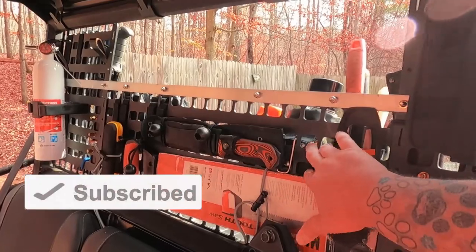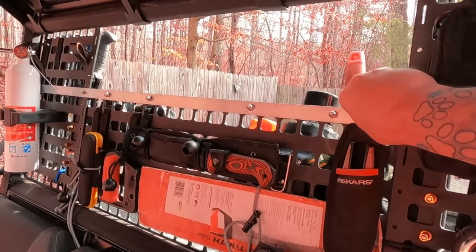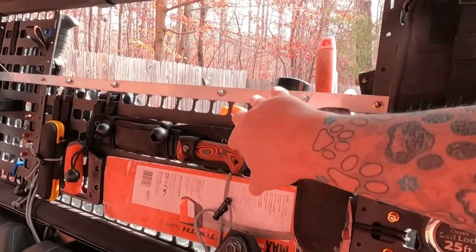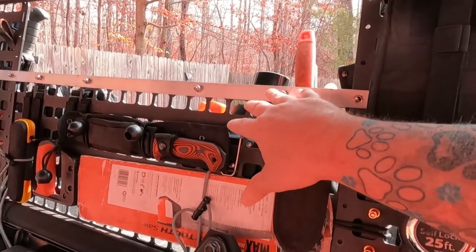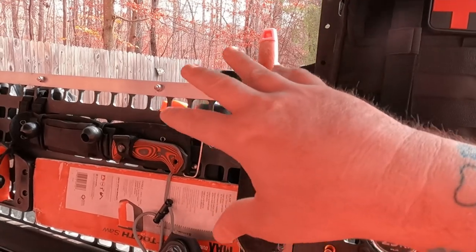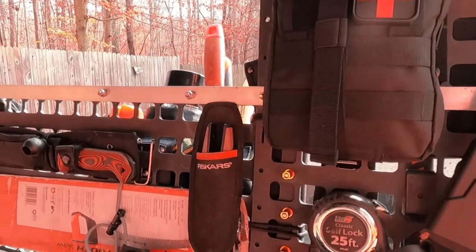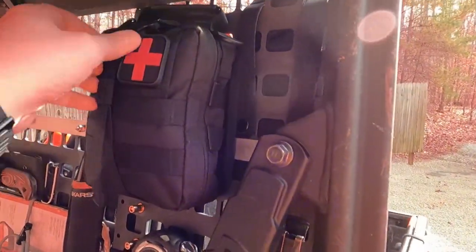My installation was completely custom - we've got the two 15x20s and the 33 or 34 by 13 as a crossbar going across there. I did go out and get this aluminum flat bar and drill it myself to give this a little more rigidity since it was such a long span. They make steel bars for some of their panels as stiffeners if you've got a lot of weight, but they didn't have anything that was going to be the whole 57 inches across, so I made my own out of aluminum. Everything is held up good.